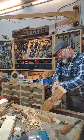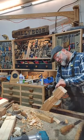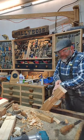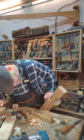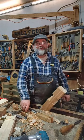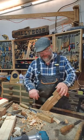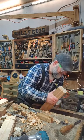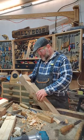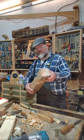More likely to get an error. Sometimes not the case. Some materials, for instance, you want to work quicker than others. Like, for instance, cherry, because like I said before, it burns if you go too slow in machines. Well, I had a load of cherry panel doors to make for a customer. When you're doing all the moulding on the edges of the panels, with my big old router bits, I was constantly sharpening that flipping thing up. It was cutting, but it was burning as well at the same time, which wasn't very helpful. I found a little bit more. Getting close.